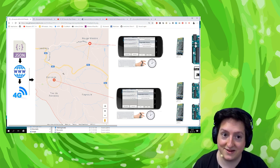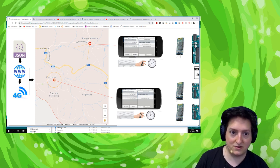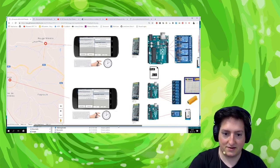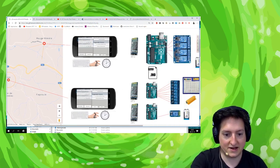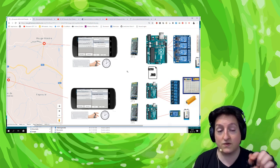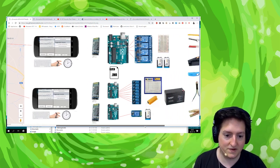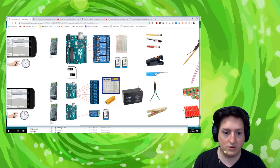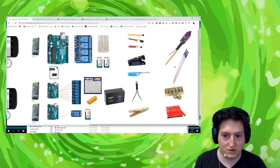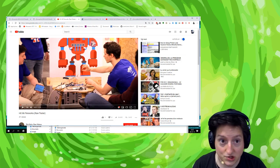So basically what we did to do that is we take the JSON, we store information of when the firework has to be triggered. It says, this phone, do you have this HC06 with a MAC address? So it's an address that is just for this device. And if it has it, it puts some voltage, the voltage uses the battery to burn a cable, and the cable burns up the firework. If you want to see what it looks like, I will show you this video.